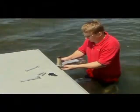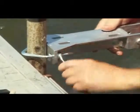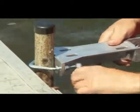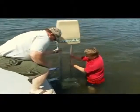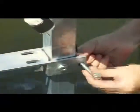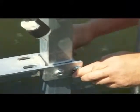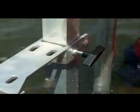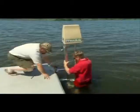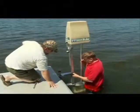Mount the brackets at least 18 inches apart for maximum stability. Install two 3/8-inch washers and nuts on each V-bolt or U-bolt and torque the hardware to 30 foot-pounds. Place the square support tube of the drive head in the adjustment brackets. Secure the unit with a 3/8-inch carriage bolt, spacer, washer, and nut for each bracket. Then install an adjustment knob in each bracket. Slide the drive head up to bring the gearbox close to the water surface and lock it in place with the adjustment knobs.